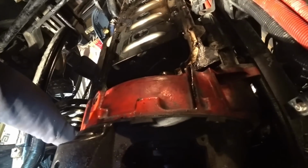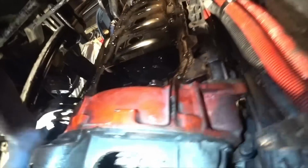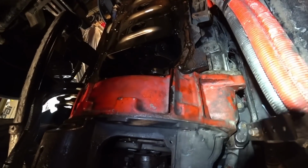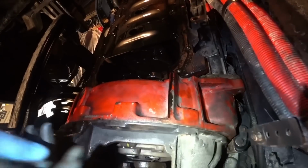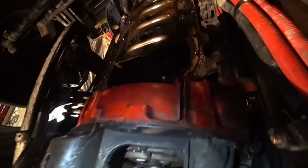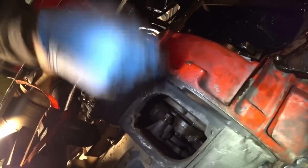I am a little bit low in the back. I have just a little bit of a gap up here, so I'm gonna take it back about an eighth inch or so, get that nice and tight, and then I'll start my bolts and start feeding my bolts all the way around here. But there we go, you guys can see, we're in there.